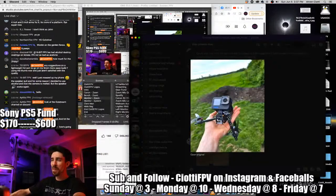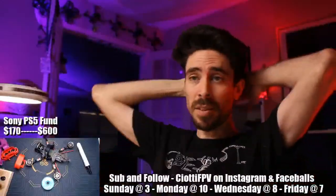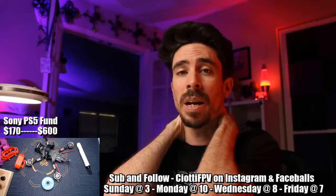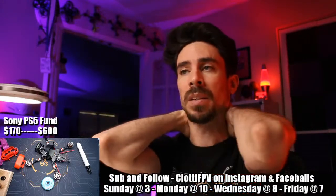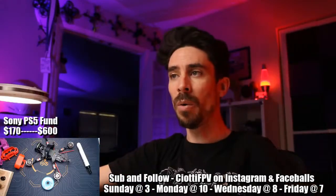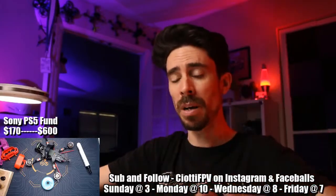The 2Fiddy frame has very thin arms. This camera is going to make this frame all-up too heavy, and these arms are going to break like crazy. So that's another big consideration when I do build planning with folks. When they tell me that they want to put a Hero 8 up in the air, I'm not going to suggest a frame that has skinny arms. So if I was working with Athix on that, and he told me he wanted to put this, that's actually a Hero 10, up in the air, I would have talked him out of the 2Fiddy frame and into something like the Impulse RC Micro Apex, actually.